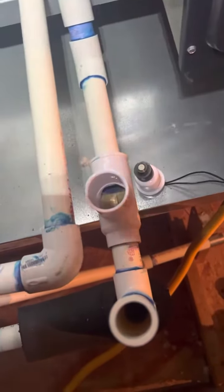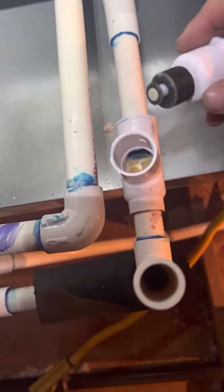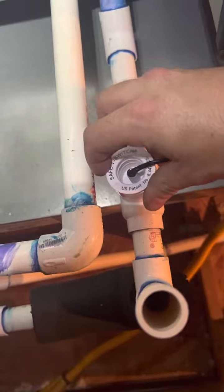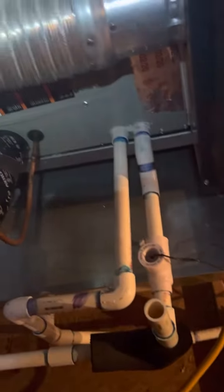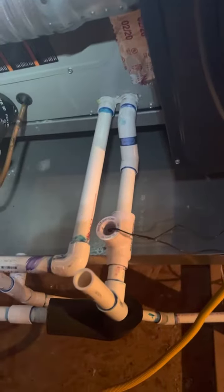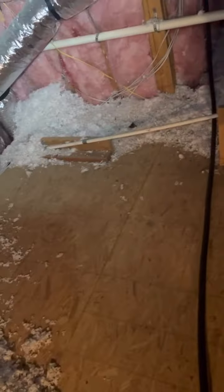Really, this drain should take a full gallon of water without even stopping. In Texas, these air conditioners will remove 20 to 30 gallons of water a day on a good hot humid day, and it won't take a gallon of water in this short of a drain line.